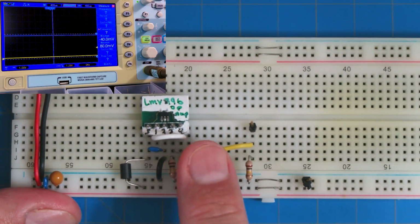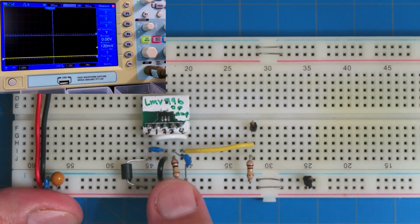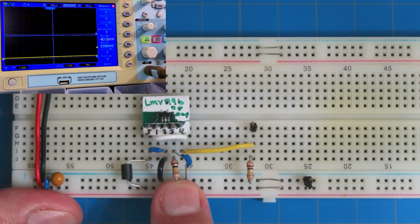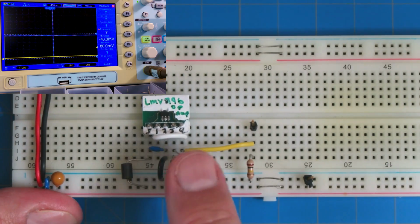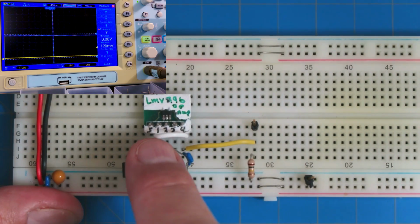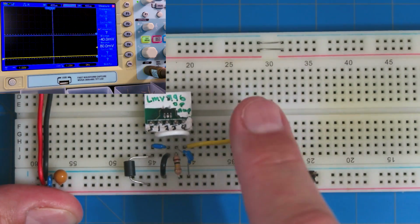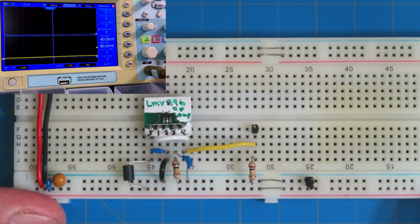And then this little capacitor right here, don't worry too much about this. This is for high frequency noise to go over the resistor. So it's a bypass over the resistor so that there's an AC path and a DC path. This is kind of an op-amp thing. Don't worry about that, it'll work fine without it, but I like putting that on there. Again, that's a 0.1 right over that resistor. And then here's the output, and you can see the output goes back to the input there. There's that 100K I talked about, just to give it a load. We're going to take the output here, and there's ground right there, right? Okay, so I think that's it.